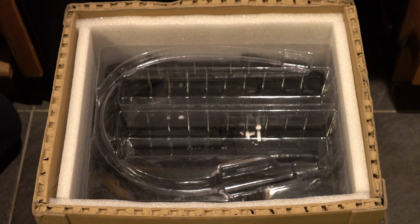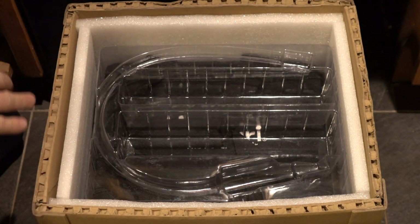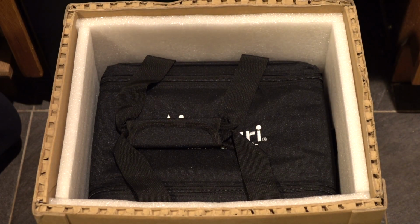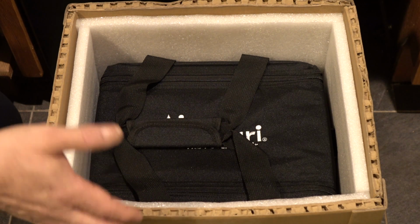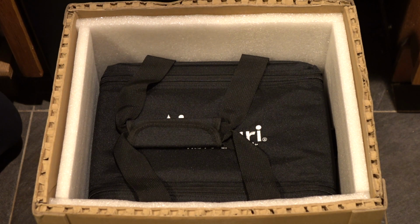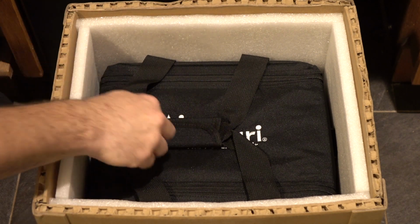This compressor is made just to fill up guns. It's not made to fill up giant SCBA tanks. So I'm guessing it's going to have an auto shut off. You just set it at 300 bar or whatever. It fills your gun up, shuts off. Then you bleed the pressure, and your gun's ready to go. That way you get a full 300 bar fill every single time.